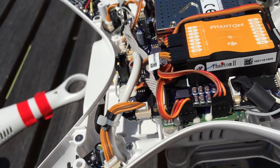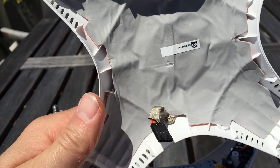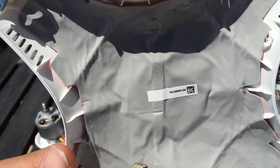The biggest complaint with this though is the GPS module, which sits underneath the top shell. Mine has had the updated braid over the cable. You can do this to your own with just copper tape — it has a little bit more of this adhesive copper backing.